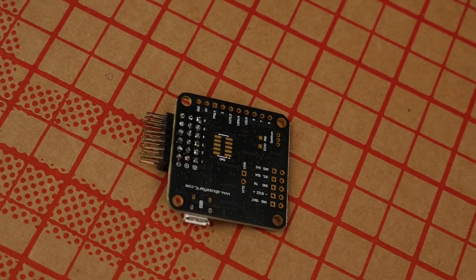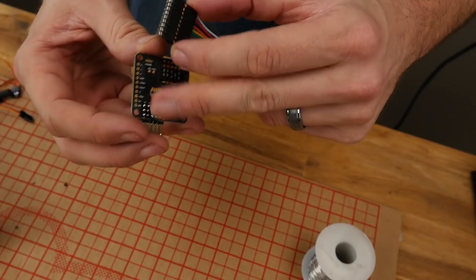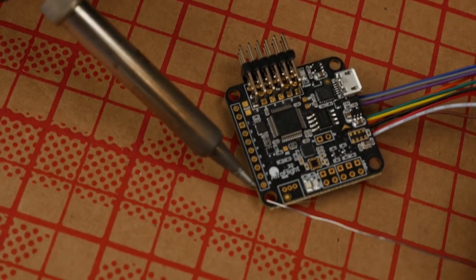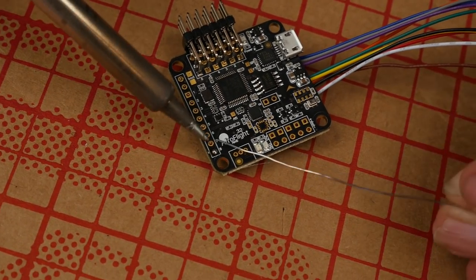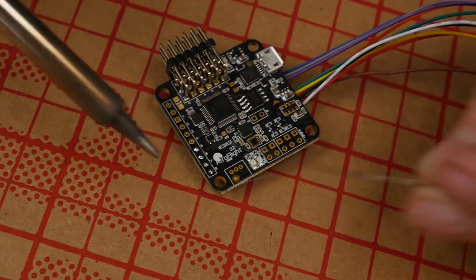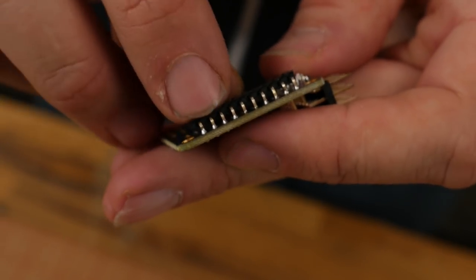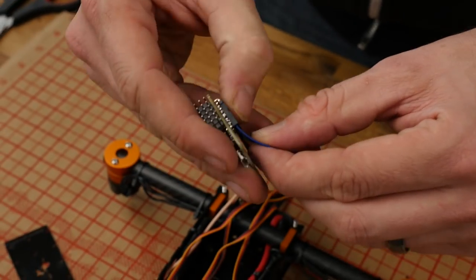Once we've inspected and we're happy with all of our solder joints, we're going to move on to our 1x10 90-degree pin. Press it in — you're going to see there's nothing that's going to touch the metal and short it out. Lay this down flat and solder it down. Start with the farthest one away. It's not how much solder you put in, it's where you put it. Take your time, one solder joint at a time. Make sure you don't puddle up too much where it bridges the gap. If you soldered your joints right, you should see a little bit of puddling wicking down each lead on your connector.